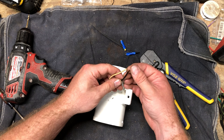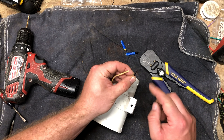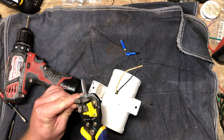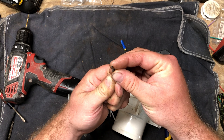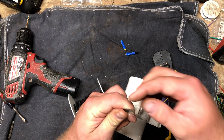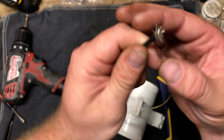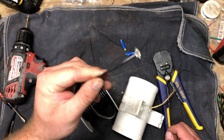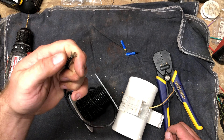If this were marine grade wire — marine grade wire has individually tinned copper strands — you'd have a moisture-proof seal. Here's actual marine grade wire. If you look close at the end, you can see the tinge of copper color, but all the individual strands are tinned to protect from moisture. If you solder this type of wire, you're going to have a moisture-proof seal. Even if moisture gets in, it's not going to corrode — it's going to last a really long time.